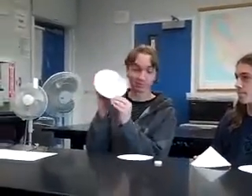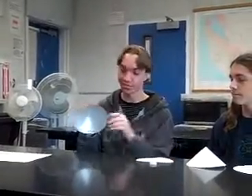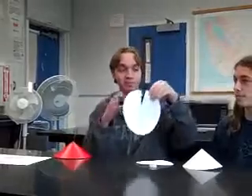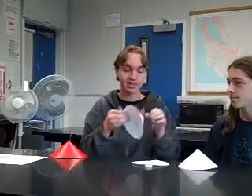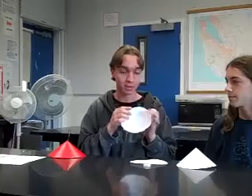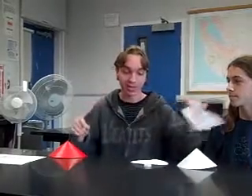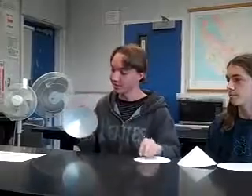The parts were a clear plastic circle and a red plastic larger circle that we turned into a cone, bound together with epoxy. We lined the inside with foil to reflect light back outwards, and the purpose of the bottle cap was to glue the LED on so that it would maintain its forward direction.